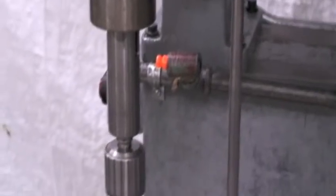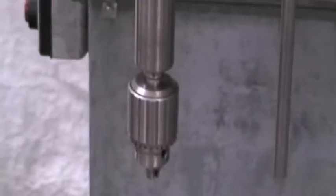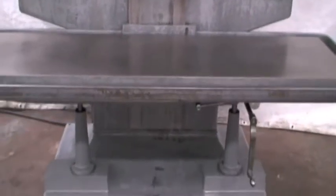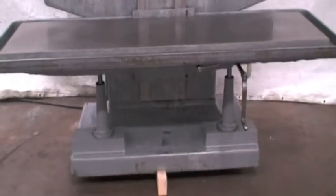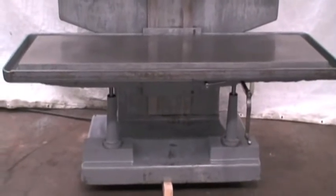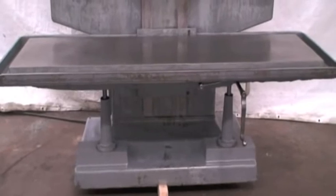It's equipped with six Jacobs drill chucks, 0 to 3/8 inch capacity. Center distance between each spindle is about 12 and a half inches. Throat distance from the spindle to the neck here is about 13 to 13 and a half inches. There's about 16 inches of vertical table travel. It's a nice big wide table — the table is about 80 inches wide, double screw, and will hold about a thousand pounds.